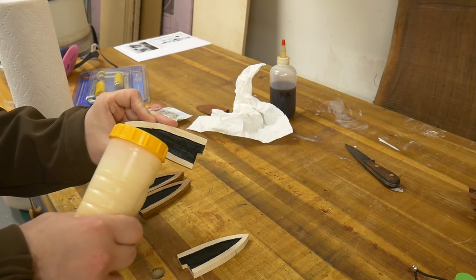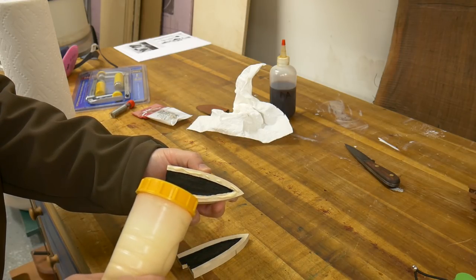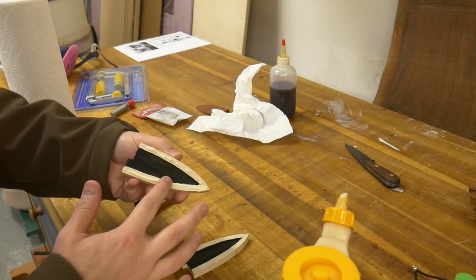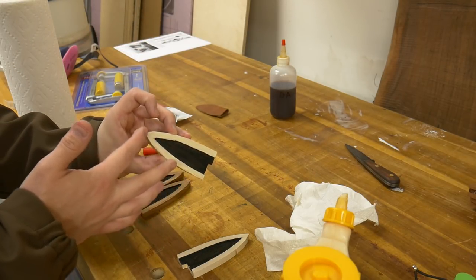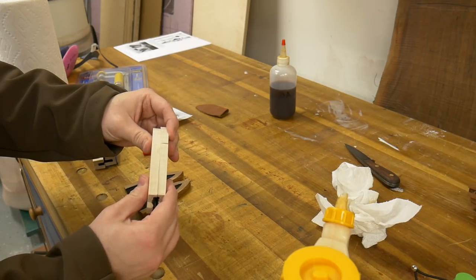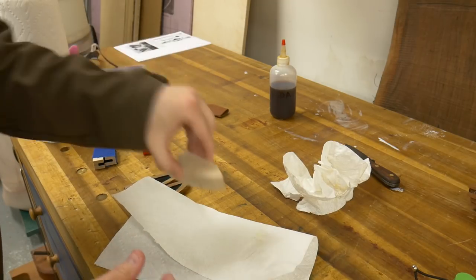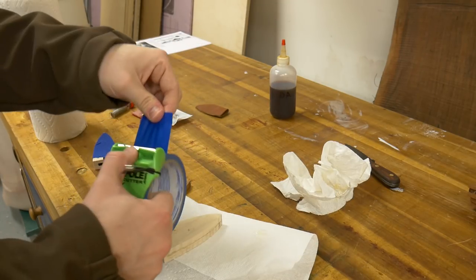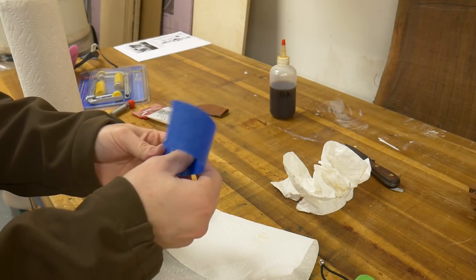Now we can go ahead and glue it up. When it came time to put the glue on, I barely put any glue on the surface because I didn't want any squeeze-out for obvious reasons. With this being such a small piece, I didn't have a way to get too many clamps on it without the piece moving, so I just did a rub joint until it started to tack up and it pretty much held on its own. Then I just put a couple pieces of tape on it to make sure it didn't move, and it worked pretty well.